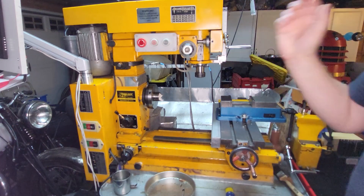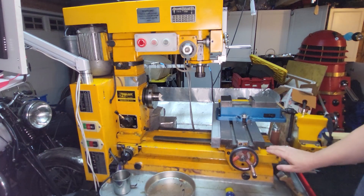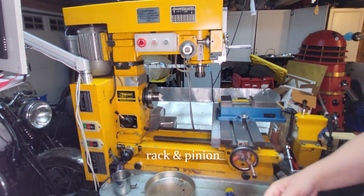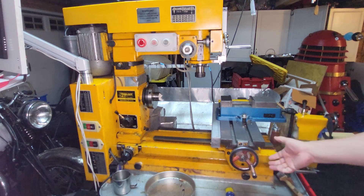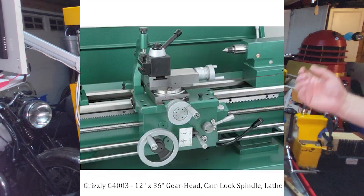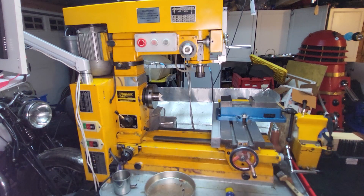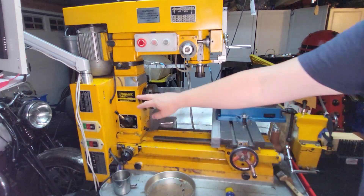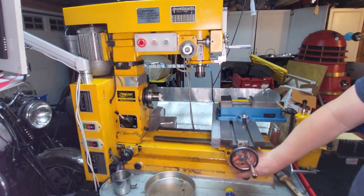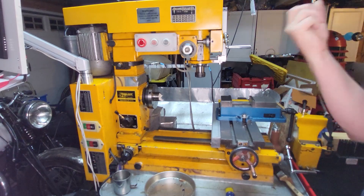It's inconvenient and more time consuming. Things that will be missing on the lathe quite often: on a full lathe apron you're going to have rapid feed with a ratchet, a half nut, a threading dial, separate power feed, and you may even have power cross feed. This machine, for instance, doesn't come with any of that — I've got a lead screw and a solid nut. Most of them will have gears to change in the back for threading, which is fairly normal on smaller machines. But a lot of those features won't be there. They're giving you a lot, but none of it is as good as the real thing.